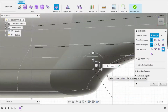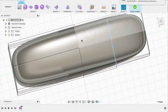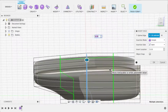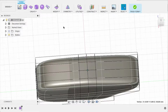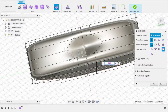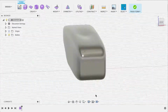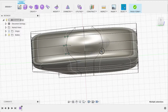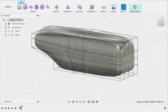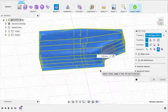Now what I've just turned on here is the control box. Essentially, the smooth shape is an interpolation of curvature between the points, kind of like how when you draw a spline, it approximates the curvature between the points you draw. This is how the shape is created. There's a control box and the whole shape is approximated, like a spline between all of the different points, which enables us to have these nice smooth edges and get some really interesting curvatures without a lot of heavy geometry that would bog the computer down.